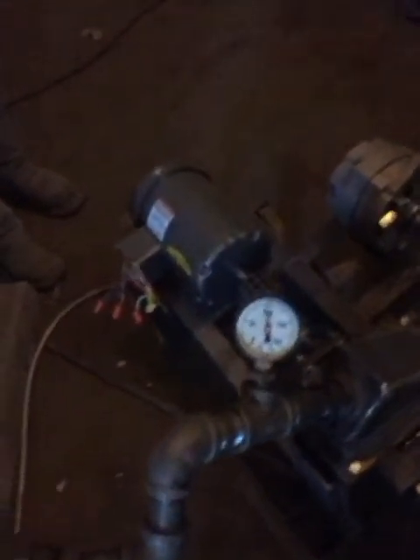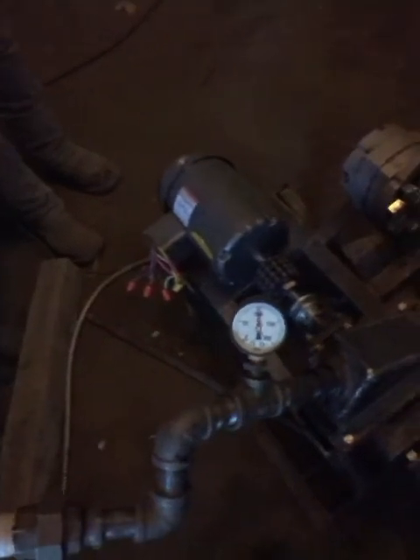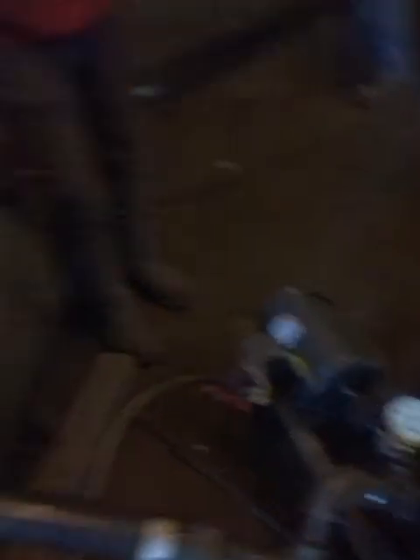It's been another couple of minutes. We're now at about 100 PSI, and once again the turbine is not rotating. She's just barely creeping — there's a slight amount of torque, she's just starting and wants to run. But it's still not enough torque to even turn this motor over. 100 PSI, once again, converging nozzle.